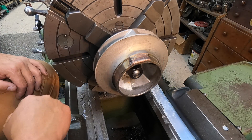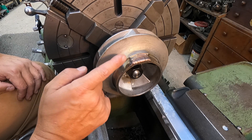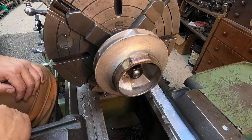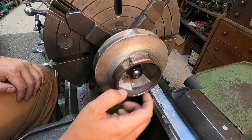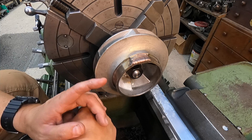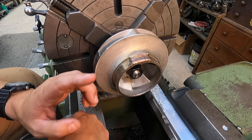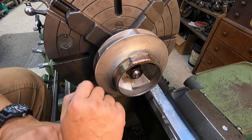We've got an update on what I'm going to do to finish repairing this impeller. We're going to turn it just like we planned, get this weld turned down. I called my application engineer Dave at Eutectic and talked to him about repairing these impellers with the metallizing thermal flame spray method. He says this is a very common repair doing these seal rings - they've done a lot of them over the years. It's a very valid way to repair this.